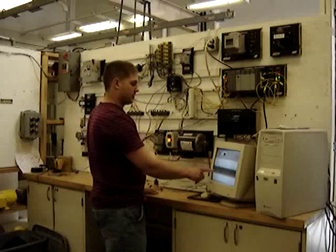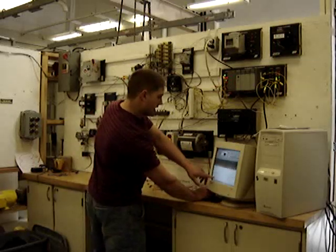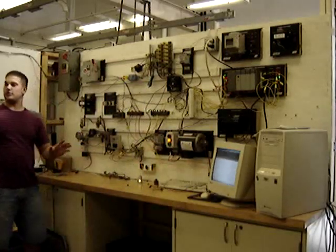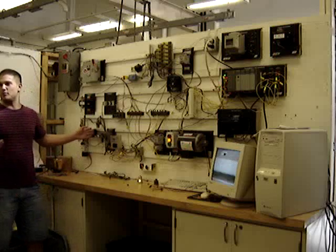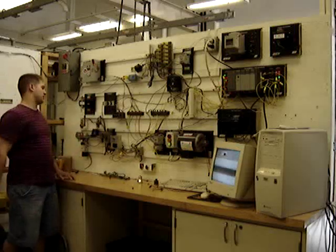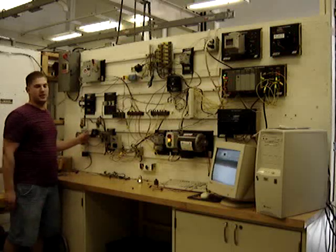It's a reversing relay right here, and you can see when it hits. It's actually resetting this timer. That timer is like a fault system too. So if there's a jam in here, watch what happens — the system shuts down. If it doesn't hit one of these in the right amount of time, it's counting down. Every time it hits there, it resets the timer. Add it to the main system over here too, so if you stop it over here, it's going to shut everything down, not just that.